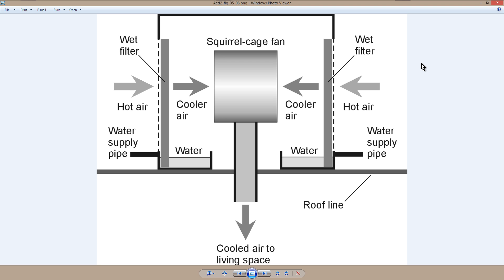The basic principle is similar to that by which a humidifier operates — the principle that when air passes through a wet filter, a wet sponge or something like that, some of the water in that sponge evaporates. And when water evaporates, it cools the air that passes through it.